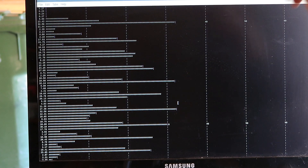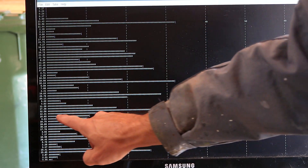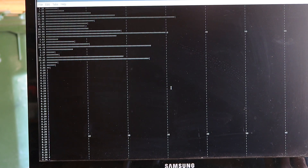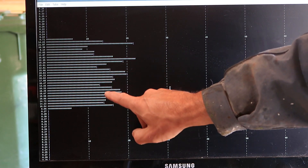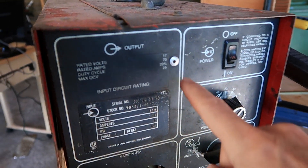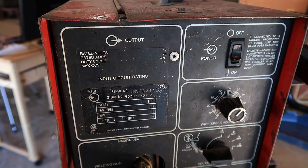The wire was feeding too fast initially and that just resulted in on-and-off arcs, but it peaked out at around 32 amperes. For a 15-amp circuit, that's nowhere near blowing the breaker. Then I slowed down the feed rate, and on a continuous weld I'm averaging around 18 amperes — pretty moderate, because some power tools like my thickness planer will use way more current when they're really working hard.